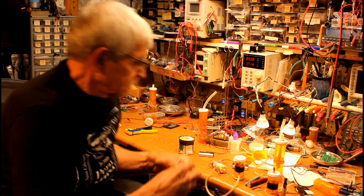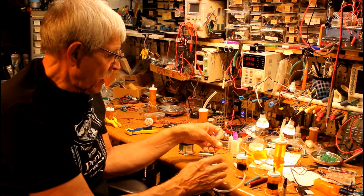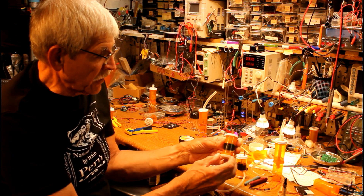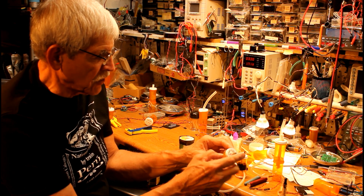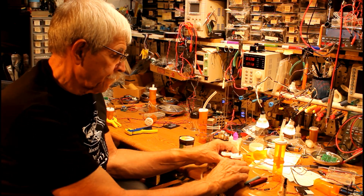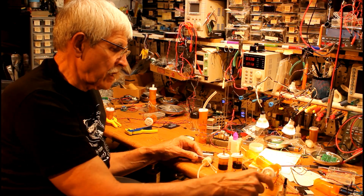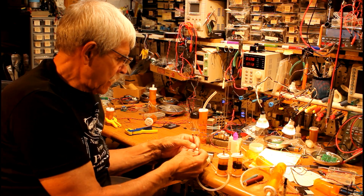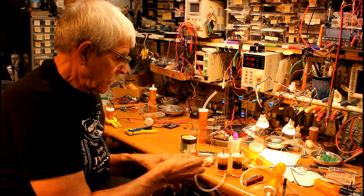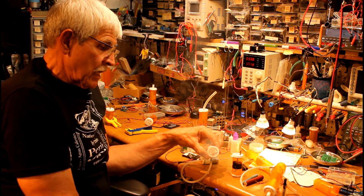With a little bit of luck, we should be able to have a functional unit just by adding a couple of connectors to the bottom to hook it up to 3.7 volts. This is a finished unit I was using for demonstrations earlier. The pump connects to the brass fitting, it's got the exhaust at the top, and there's just a little bit of juice in there. I've got a little Y connector so I can connect the motor and the heating element. This is a 3.7-volt cell phone battery — you can probably hear the motor, and once the heating element heats up just a little bit, you'll see it's putting out quite a bit of vapor.